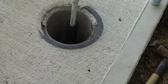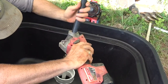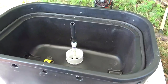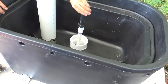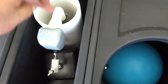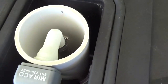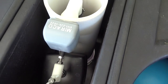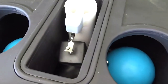We just hammer-drilled through the slab and we're setting this box back up to attach it. We're making our cut — the two-and-a-half-inch measurement is very important and that's from the top of the riser tube. Make sure you seat it in there tight before you make that measurement, then cut down two-and-a-half inches with the hole facing the right way. After cutting the riser pipe to the right height, thread this into the T-fitting — which is actually a 90-degree.